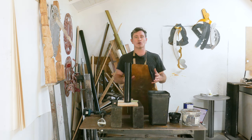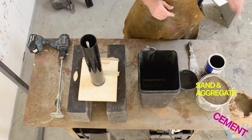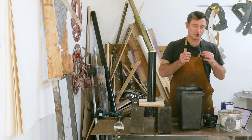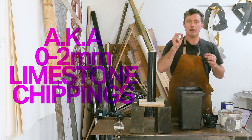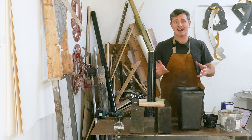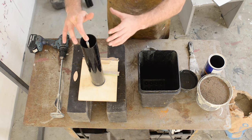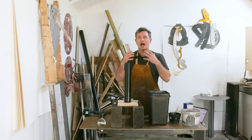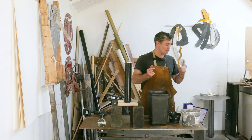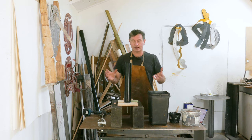The simple process for making concrete is you want cement, sand, and an aggregate. Now I've got a sand that is quite fine but also it's got some chippy blocks in it — two millimetre limestone chippings — so my hope is that it acts as both a sand and an aggregate at the same time. Because it's something so small and it's got a central support, I don't need it to be that strong. So what we're going to do is mix it all up, pour it in, and then away we go.